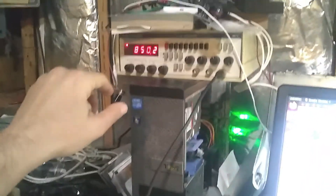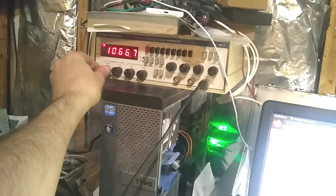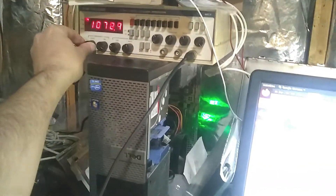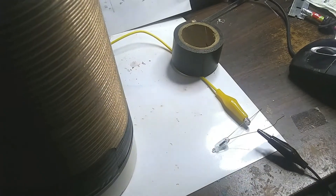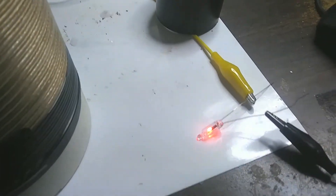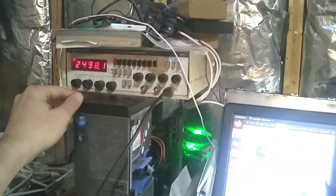There's actually a different resonance as well. This first one I found is at 850 kilohertz, but there's another one higher up. Let's twiddle around to find that one — okay, there it is. For this particular coil, that resonance is about 2.5 megahertz. Of course, if you have a longer transmission line, the resonance would probably be lower, at a lower frequency.